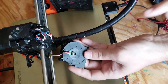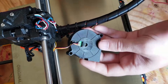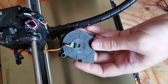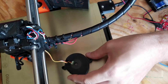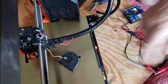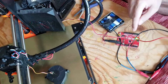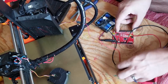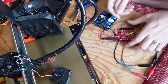So what I did is I took this off and started checking the wires here. I don't see anything noticeable, but I thought I'll solder them off, cut new links, and solder them back on and test them. But before I do that, I really want to make sure I honestly have power. So I looked this up — it's 5 volts — which happens to be convenient because I have a little SparkFun Redboard here, an Arduino board. Once I have it powered, I can pull 5 volts off of it very easily.